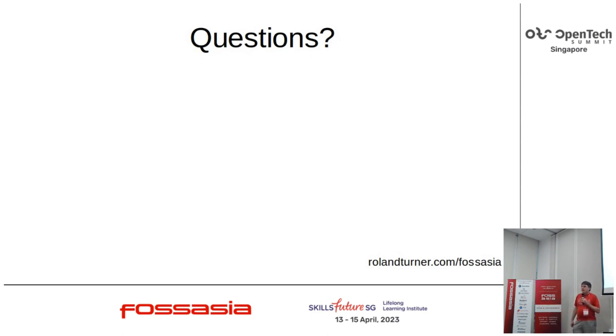More generally, at low powers, you don't in general put single digit watts, let alone tens or hundreds, into a test environment until you're certain that at the milliwatt, microwatt range everything is working correctly. And only then you start looking at power amps and all that sort of stuff. But yeah, the whole thing is a compliance question. So how do we avoid getting ourselves into a deadlock? Sure. Any others?